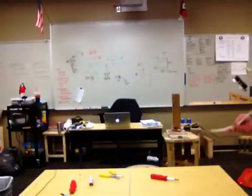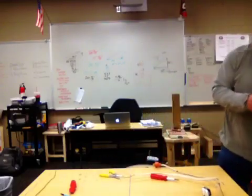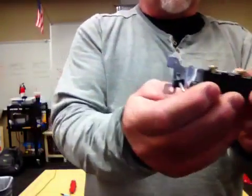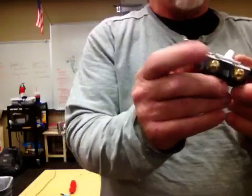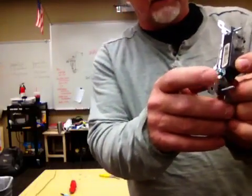Then what you'll do is you'll attach to the switch. Now I want to show you something. This is what we call a single switch, a single pole switch. If you look at this, there's only brass or dark. So guess what? You're only going to attach black wires to this outlet. Okay? The ground wire is still here.